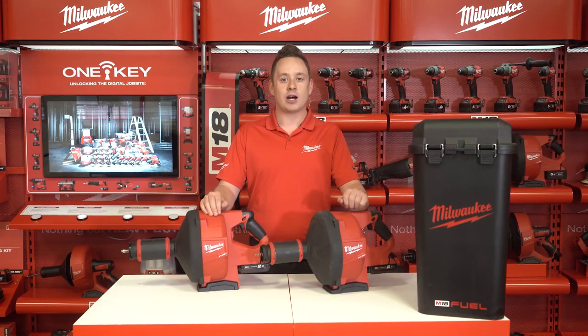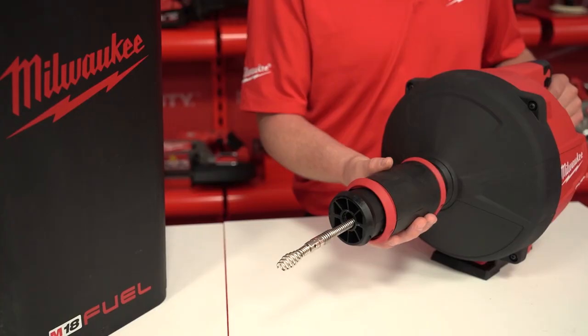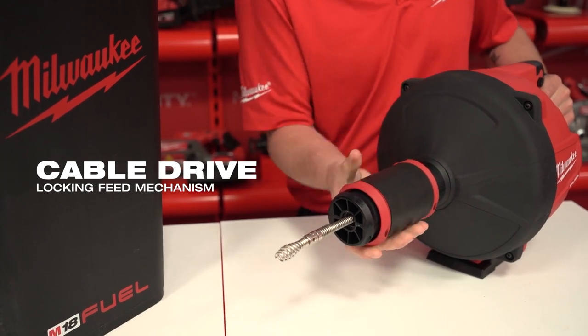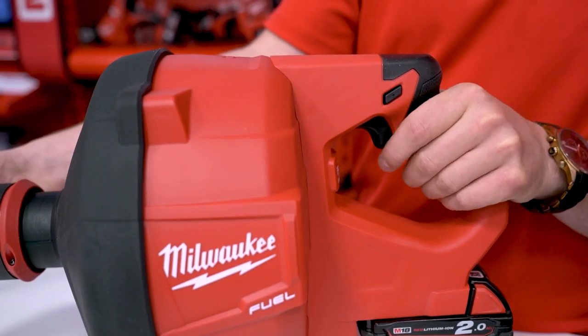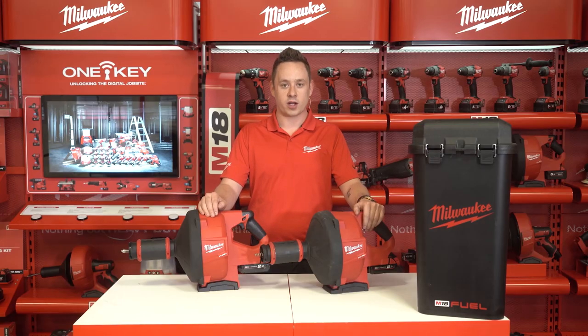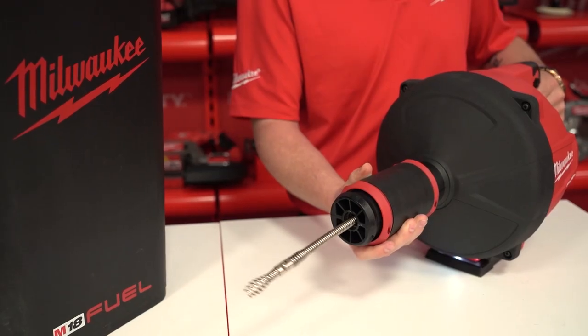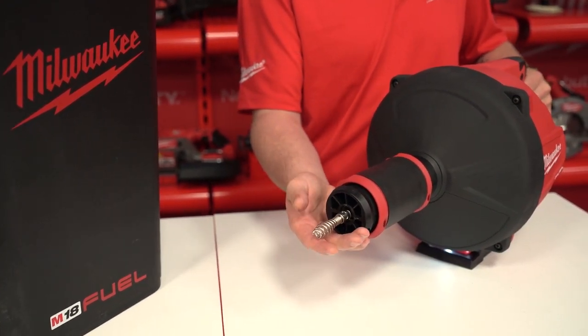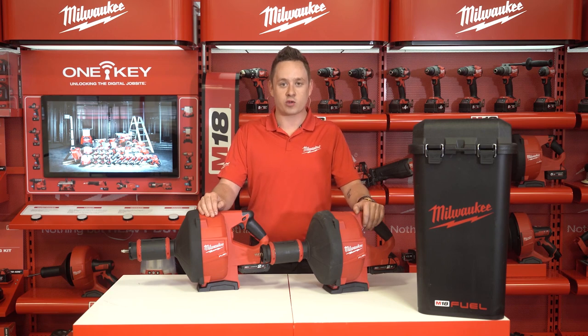This position is perfect for working the clog once it has been reached. By simply moving the tool forwards and backwards we can work the clog. Position number three is the automatic feed and retract. We take the grip at the front, slide it forwards, twist it to the right until it's fully tightened. Now by using the switch at the handle we can either feed or retract the cable into the drain. By switching the tool to the right we feed and by switching it to the left we retract the cable. This way you simply adjust the spin direction to feed or retract the cable.